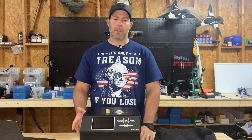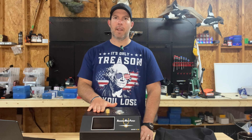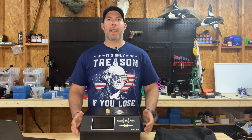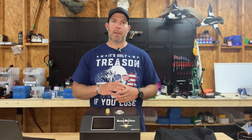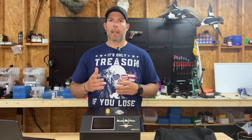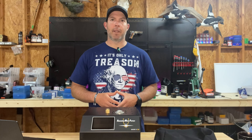Before we get into reviewing the AMP Mark II DB, which is their newest product offering in their annealing line, I want to just talk a little bit about why you might want to anneal, the benefits of annealing. The general theory behind annealing is that brass is kind of a soft metal, and as it is being fired and then squeezed back down to resize, fired again, as that brass is heating and cooling and also being stretched, it is hardening. With the brass hardening, that can affect things like the amount of times you can reload it. Commonly when folks are done with their brass cases, it's because the necks will split up the side.